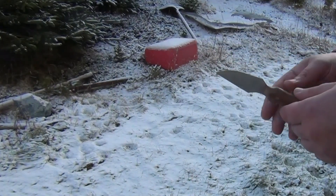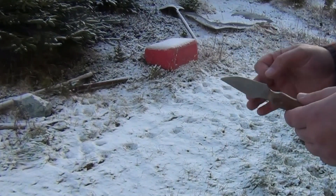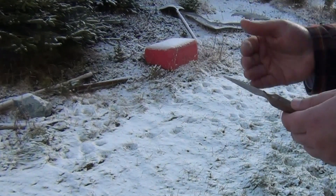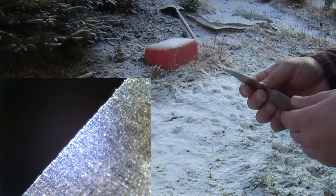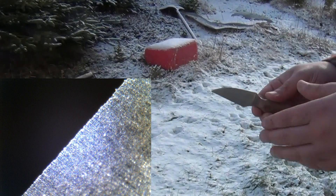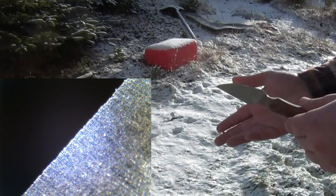It can be like one-tenth of what the edge retention should be. The ideal way to be absolutely sure is to look at the knife edge under magnification — anywhere from 10 to 50 times is easily enough. And if you see the edge form very clearly, you check it on both sides, it looks perfectly clean, and you make a test cut and it appears to be sharp — well, there's no burr.